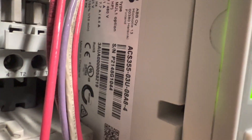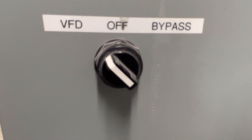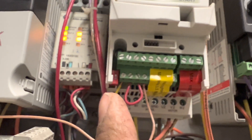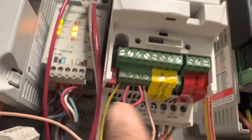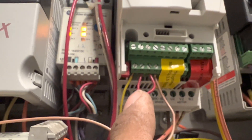We're going to use a basic on/off switch like this one. If you look under the VFD, you can see the yellow wire is connected to terminal number 9 and the brown wire to terminal number 12. Terminal 9 is the low voltage power coming out of the VFD — it goes to the switch. When you turn the switch on, it completes the circuit, and the brown wire brings that power back to terminal 12, which starts the drive.